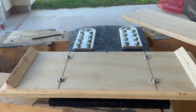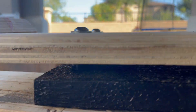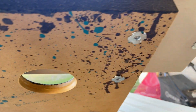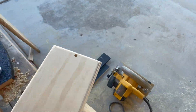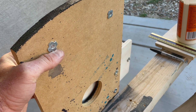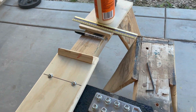Here's a quick look with the lithium cells out. Everything comes apart - this sits on there like that, then I have these big long quarter-20 bolts that hold it down, and these little allen head bolts run into t-nuts. Even these pieces have t-nuts so if I need to take them off I can. I'm going to cover these bus bars with foam or something since one is a positive run and we don't want that to short out.